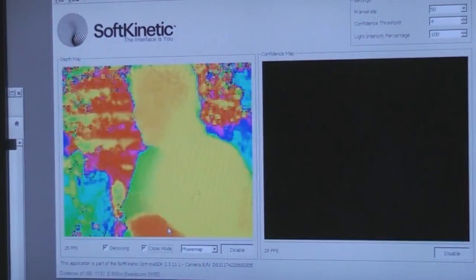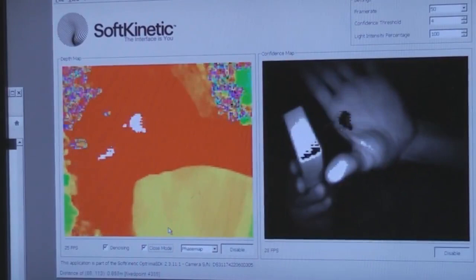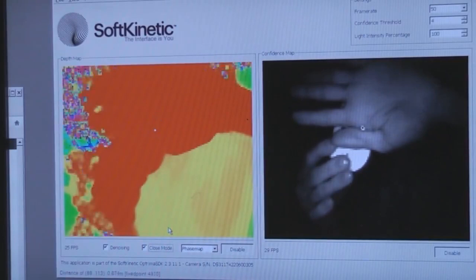I was playing around with an infrared LED just to see if I could confuse it. I found a quite interesting effect: if you actually shine additional infrared and look at the confidence image, it's almost like you've got a dark emitting diode. When it's off, you can just see a little twinkle from the reflection, but as soon as you turn it on it looks like it's emitting darkness, which is quite fun.